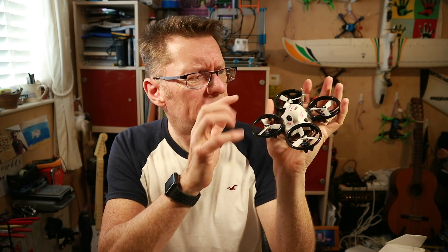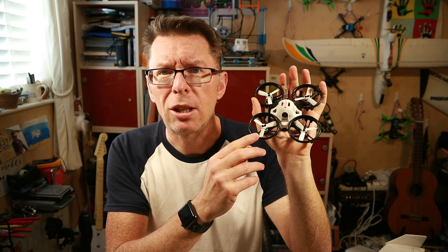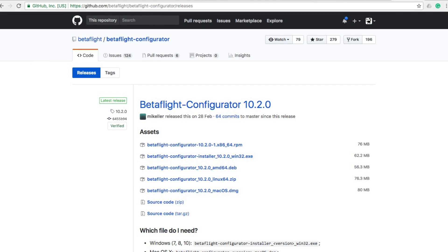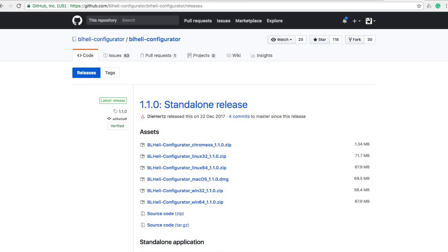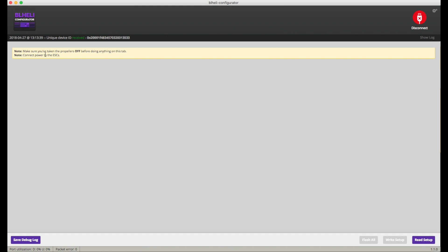Let's get the top off so I can plug in and go through the software updates we need before configuring Turtle Mode. Both the BLHeli and Betaflight configurators are now standalone applications. Most people know where Betaflight is, but in case you don't know where the BLHeli configurator is, I'll include both URLs in the description below. I've connected the ET100, so let's connect to it — it will give sensible advice about removing propellers before connecting power.